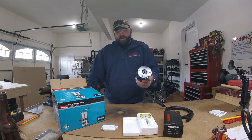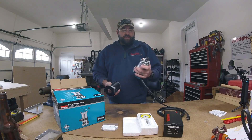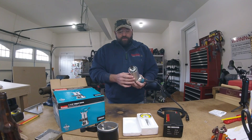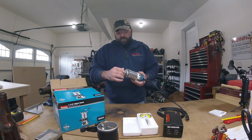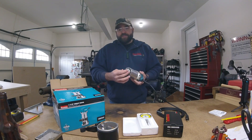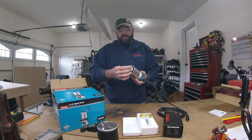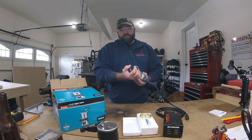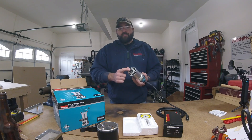I've got one of the Makita RT-0701C trim routers that is very popular in the industry for CNC router tables. One of the things I'm going to do today is check spindle runout. I have a feeling it's not going to be quite what I want. If the bit wobbles a little bit, it can increase the size of what you're milling. If you're trying to do high-tolerance machining, it can affect your cuts — it essentially increases the kerf of the bit. You can correct that in the tool database by increasing the size to accommodate for runout, but I'd rather not have any runout at all.